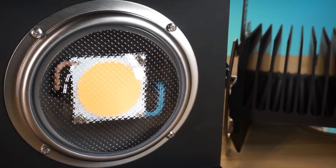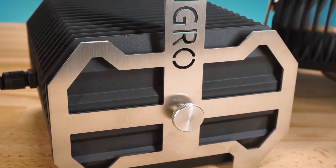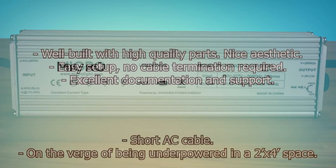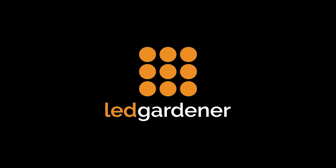All in all, this is a solid kit. The best things about it are the aesthetics and build quality — these are the nicest looking lights I've seen to date in this space and everything feels high quality. The design is well thought out, resulting in an attractive, sturdy, IP67-rated light. Having all cables terminated out of the box makes setup simple. The short AC power cable may make running the driver remotely difficult. At 220 watts output in a 2 by 4 foot space, you get 27.5 watts per square foot, which falls slightly short of the typically recommended 30 to 35 watts per square foot — but the 200 Plus still puts up respectable numbers thanks to the efficiency of the new Gen4 CXM32 COBs. Hit subscribe if you're interested in more DIY LED content, and check out Migro's web page linked in the description.